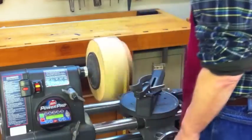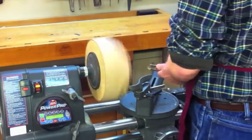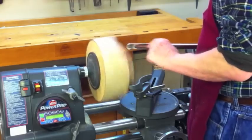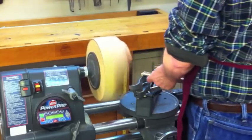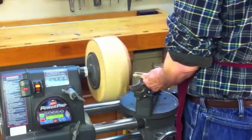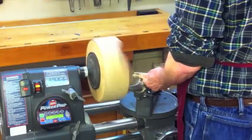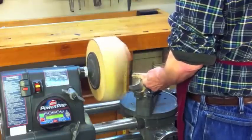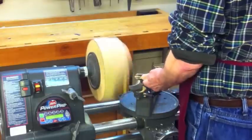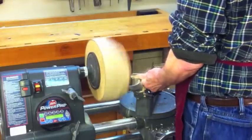I am going to turn the machine on — we're ready to go. You'll notice that's turning about 400 RPM. And the initial startup, you may have noticed there's a little hesitation. What's happening there is the computer inside the headstock is actually taking a reading of the torque power requirements, so it can know what to do and make the right adjustments.